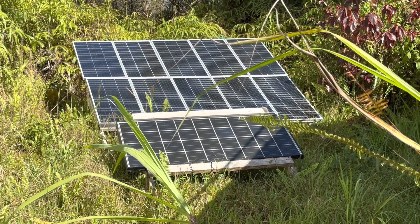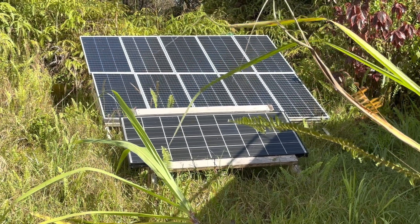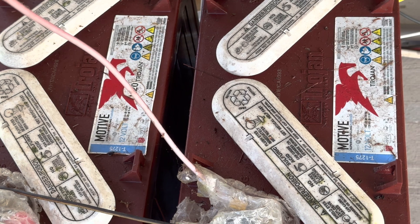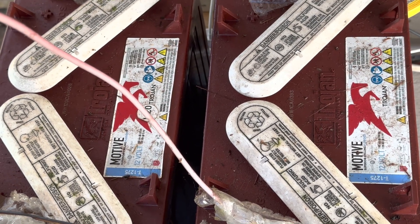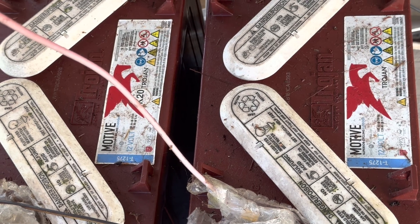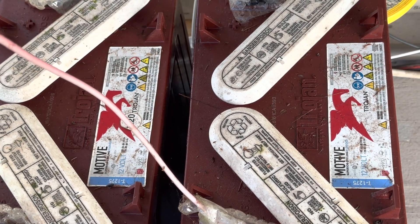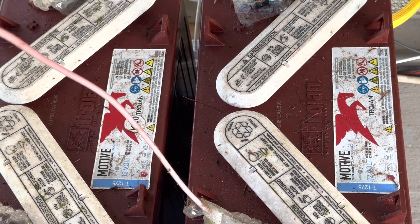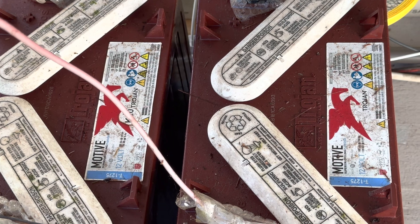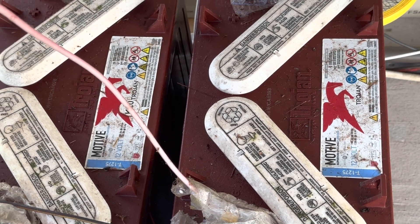While I've always used photovoltaic solar panels for capturing power from the sun, it's the storage capacity that has changed in the past couple of years. For 28 of those 30 years I always used lead acid batteries — here I have two of the last ones in service. These are a couple of old Trojan motive batteries, 150 amp hours each, tied together for a 300 amp hour bank, but only 150 amp hours really available because you don't want to drop them below 50% without degrading them. Before lithium iron phosphate came around, these were the gold standard — they're obsolete now.